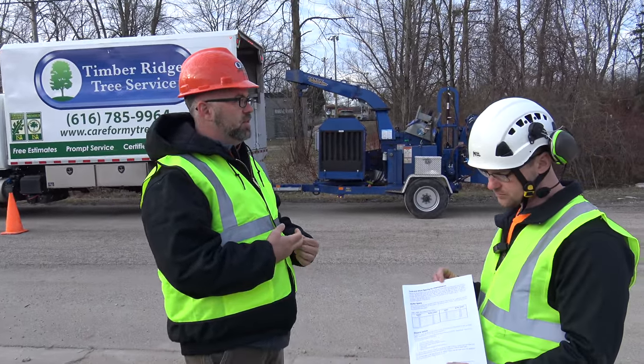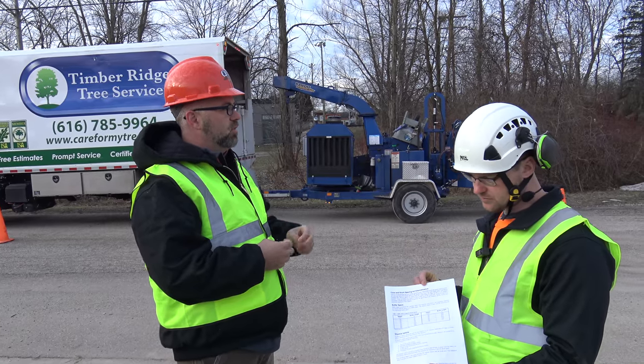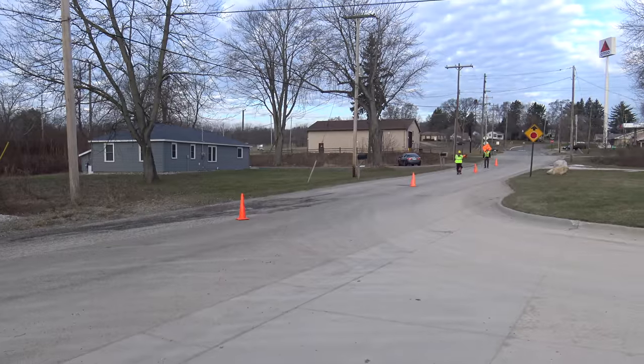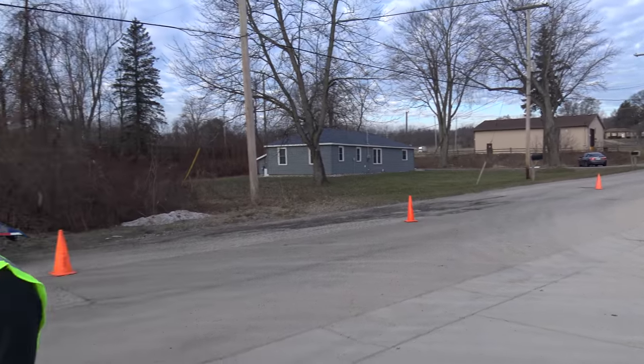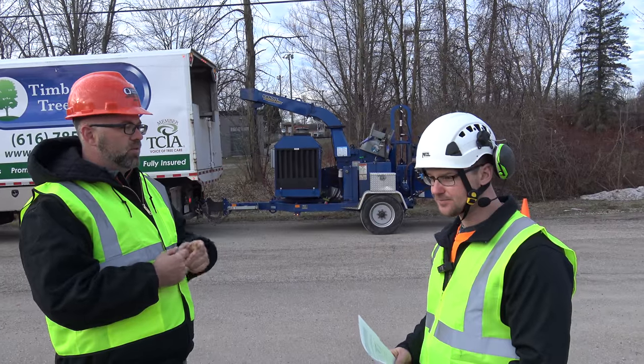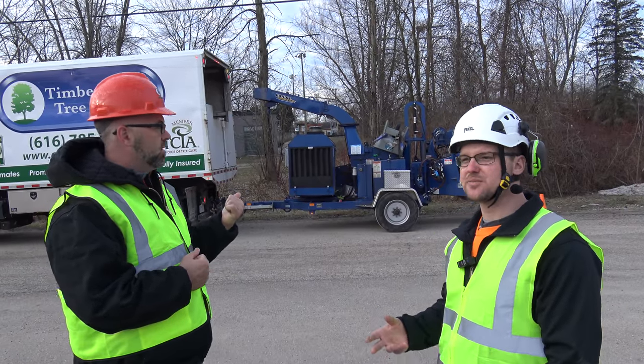And our cone separation will be 35 feet because this road is 35 miles per hour. And a road that's 45 miles an hour is going to be 45 feet cone separation. And then let's talk about buffer zone.